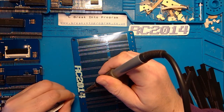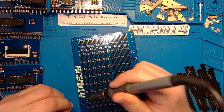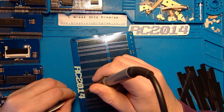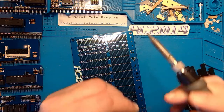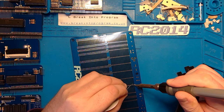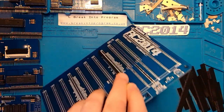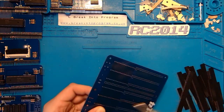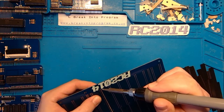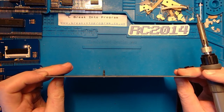Let's do the top and bottom pins first - melt temperature first, then a bit of solder on there just to conduct heat a bit better. One down, four billion to go - all part of the fun of it. Two down. Let's do a quick visual on that - I'll hold it with a couple of fingers, it looks straight-ish, and I can just rock it in place. That looks 90 degrees on the nose - well, I haven't measured it but it looks likely.